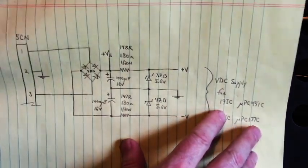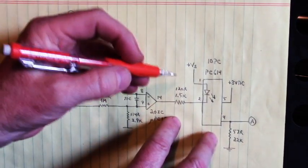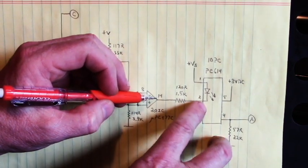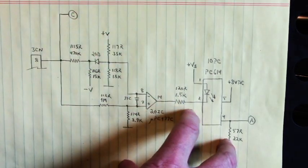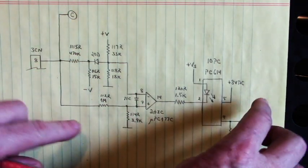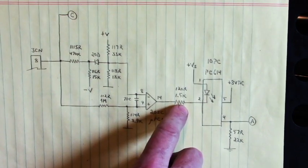Now, what did you do to fix it? Since nothing was bad, what did you do to fix it? Well, I didn't fix it. But I had to get the machine running. So I disconnected this circuit right here — the output of the voltage comparator to the input, the cathode side of the optocoupler. And now that circuit could not lie to the control board, to the hybrid module on the output side of the optocoupler. And to this very day, all these years later, with that resistor removed to defeat that circuit, that drive is still running.